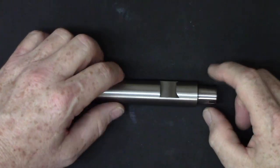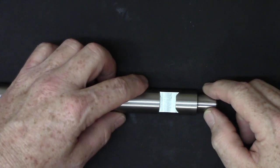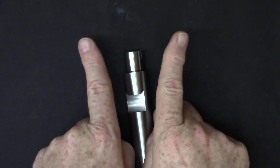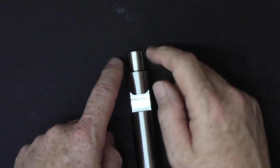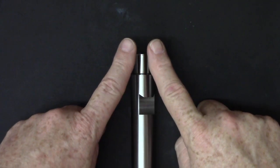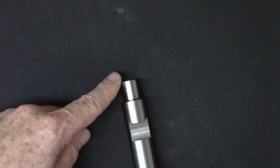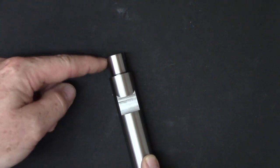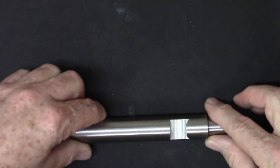That'll work fine, but you really need to measure — measure, measure, measure. Because the last thing you want to do is create a taper that's shaped the wrong way. By the time you get it started in there and you think it fits, you're going to be really loose and you're going to have a barrel that wobbles. Even if you have a taper going toward the end of the breech, at least you'll be getting it in there and fighting as you go, but you'll be loose out on the end. So you'll still get some wobble and you won't get the fit that you really want.